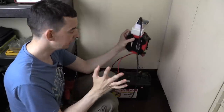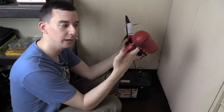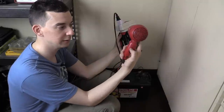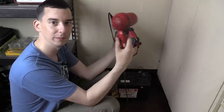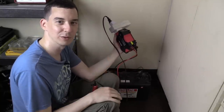So yes, I stand corrected — I did make a mistake in my first video. It could handle the hairdryer on setting 1, which is around 200 to 250 watts. And then if you try and go higher, for instance its top setting of 1000 watts, then it will turn itself off to protect itself because it's not designed to handle something that heavy. So thanks to the commenter. And if you enjoyed this video, please give a thumbs up and subscribe.